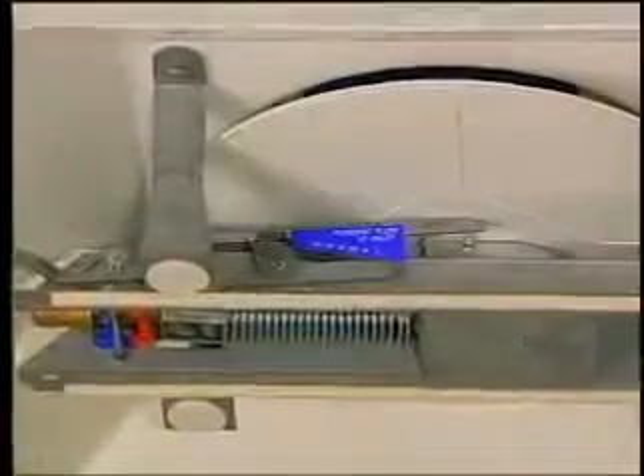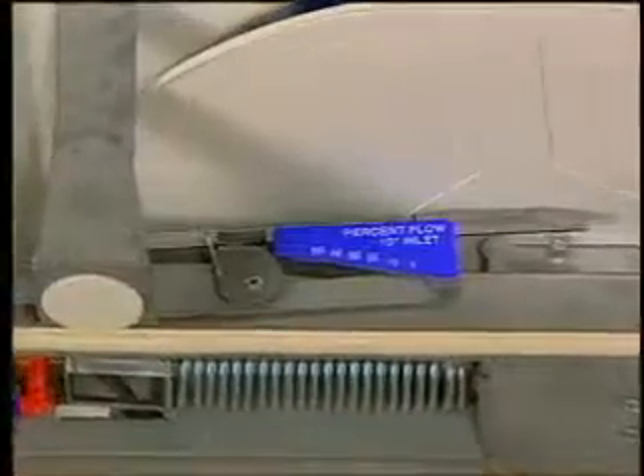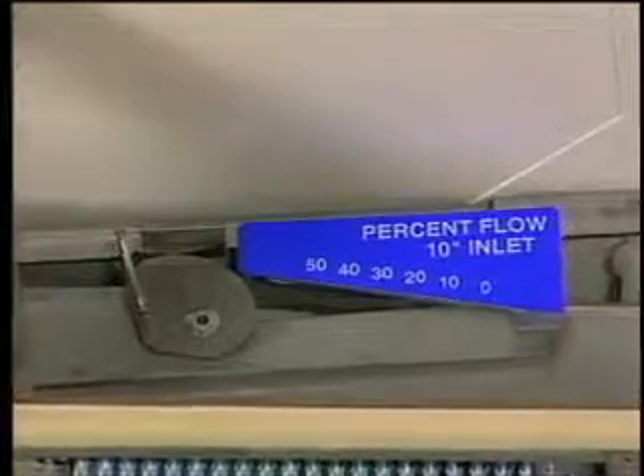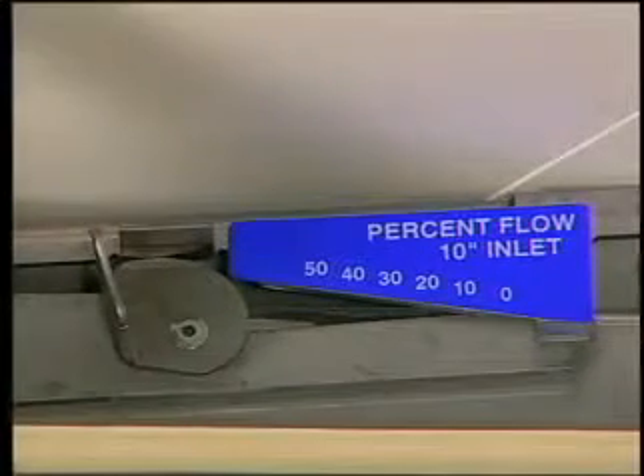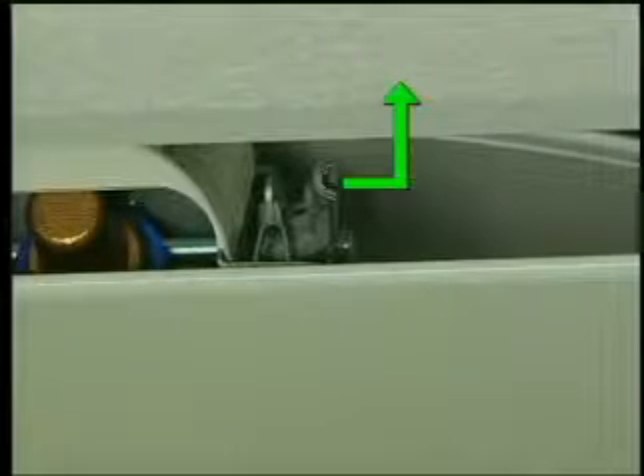In addition to separate VAV heating and VAV cooling set points, the STHC has a dial-in minimum flow stop. Simply turn the dial on the side of the control arm to the desired point on the percent flow scale. Another feature of this diffuser is that the damper can be opened for balancing without opening the appearance panel by using a balancing lever next to the induction air inlet. Push this lever to the right and then up to open the damper. To close, push the lever down until it catches on the small latch.